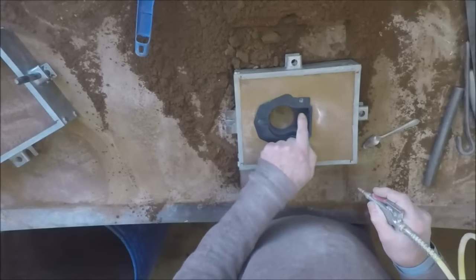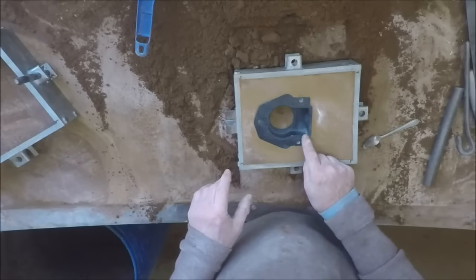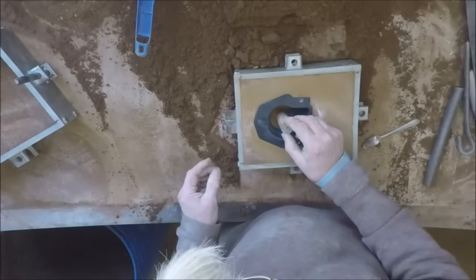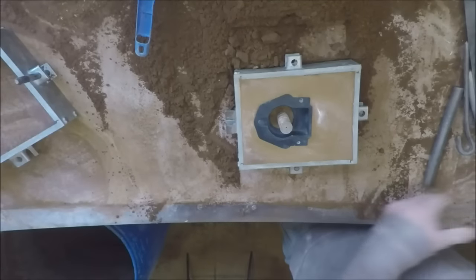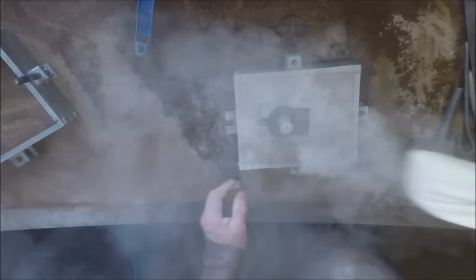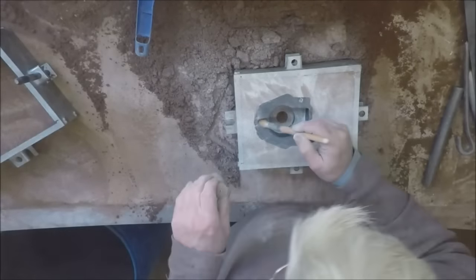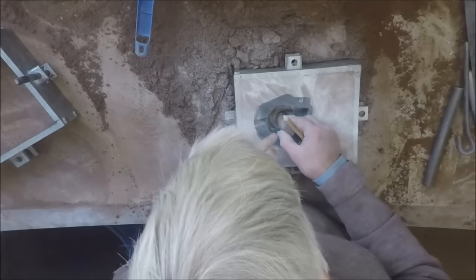Now, the lump of sand that forms the inside here is of course going to hang down in the eventual mould, and there's a pretty good chance it'll break off around this level unless I reinforce it. So I'm using something akin to a cotton reel, just made out of a bit of aluminium bar. We sit that in the middle like this as a reinforcing peg. Parting agent. Sweep it off the pattern. Naughty little cotton reel, wants to fall over. Back you go.